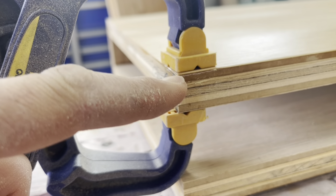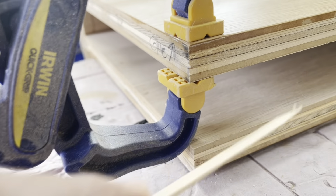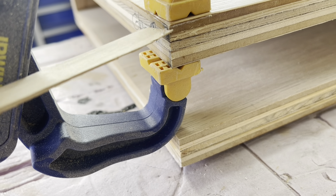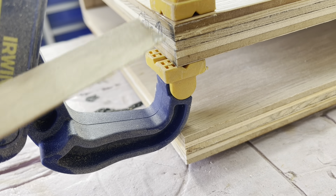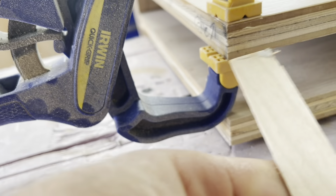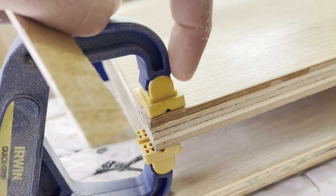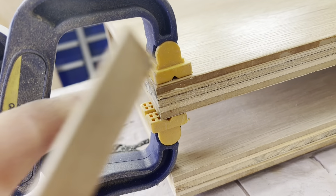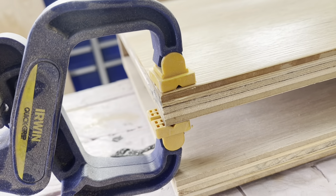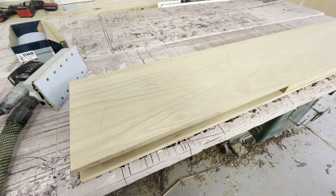While I was on the job site there was a minor delamination — this corner popped up while I was test-fitting. I marked it, pulled it up with my finger, and put a little wedge in there — just a piece of scrap as a small shim — which allowed me to get some thin glue on my finger and rub it in, then do both sides. I wiped any excess off the top with a wet rag, clamped it, and wiped with my finger pointing down away from the top. In about 30 minutes that'll be set up and ready to work with.